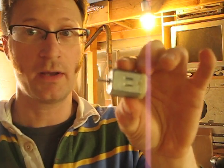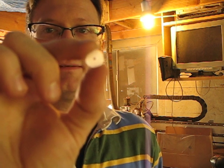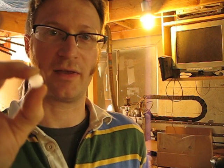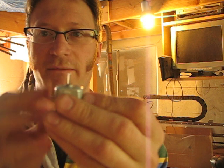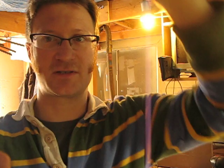Here's a small DC motor that you can get at jameco.com. What I've done is I've made a small disc of polyethylene — specifically, high density polyethylene. You can get this from various online plastic suppliers, or if you're lucky enough to have a plastics place in your hometown, you can most likely get polyethylene there as well. This disc has a small hole in it, and this hole is smaller than the diameter of the shaft of the motor. They form what's called a press fit, where friction holds the disc onto the shaft.